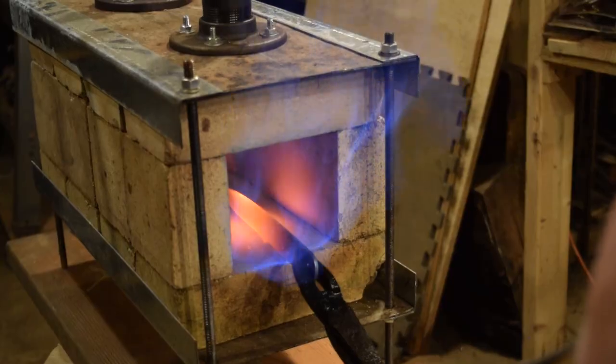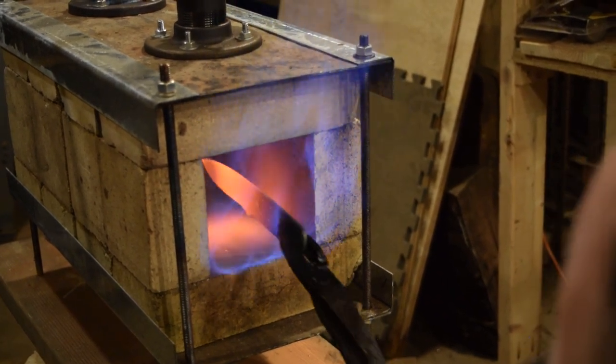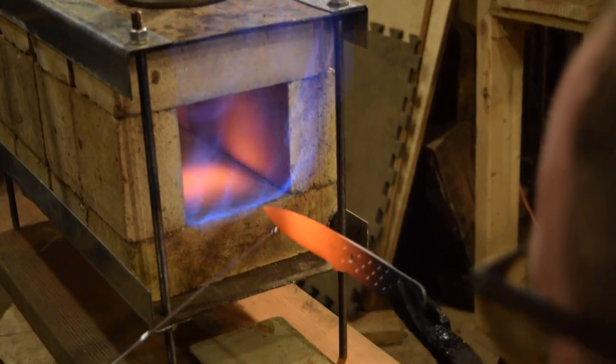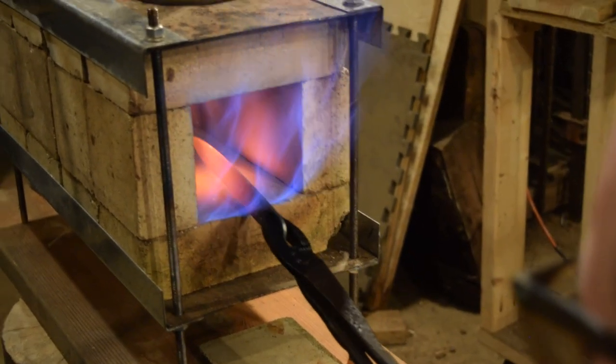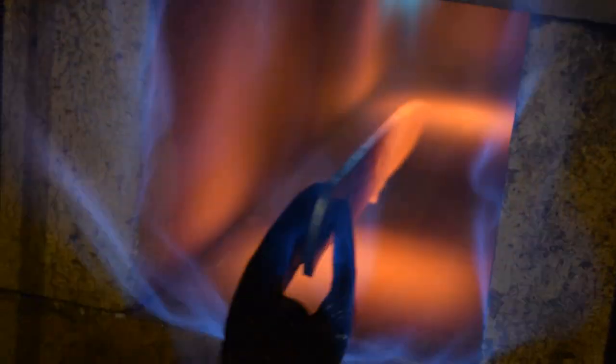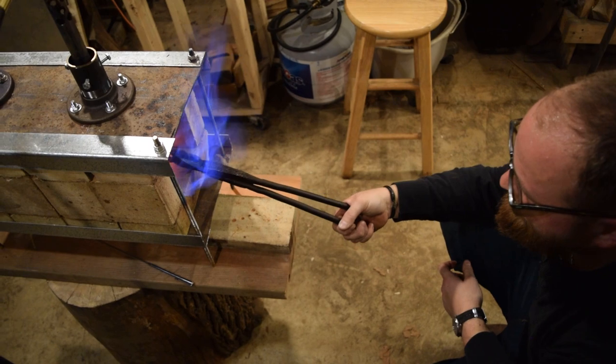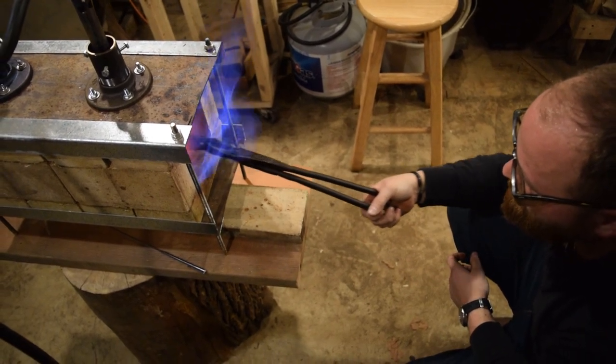When I go in for the quench, I'm also going to make sure that I am quenching the edge of my blade as evenly as possible. I'm going to make sure it goes nice and straight into the oil, and also as evenly and as much of the blade as possible. So I'm going to tip my tongs up so that I can quench my knife as evenly on that edge. The reason you want to do that is because when you're quenching steel, you need to make sure that both sides of your steel are cooling down at the same rate. If one side cools a little different, you're going to get more warping. Now, warping is something that all knife makers have to deal with, but anything you can do to keep yourself from getting warping in your knife is the best thing to do. So I'm going to try to make sure I go into my oil really even and really straight, so that I don't get more warpage across my blade. Try to get even cool down to get below that non-magnetic temperature and harden the blade.